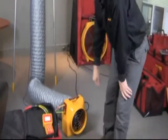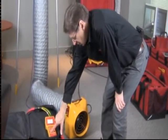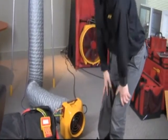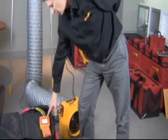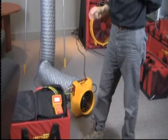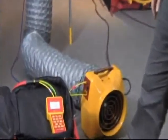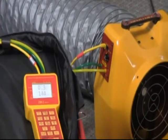This is a supply register, so air is blowing down into the inlet of our fan. All we do is go: set pressure, zero, enter. Once this reduces the pressure inside the pan down to zero, we will have the exact flow rate coming out of the register.